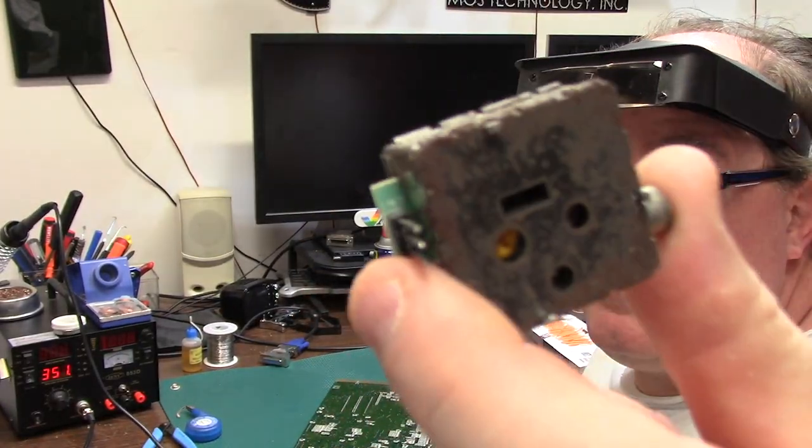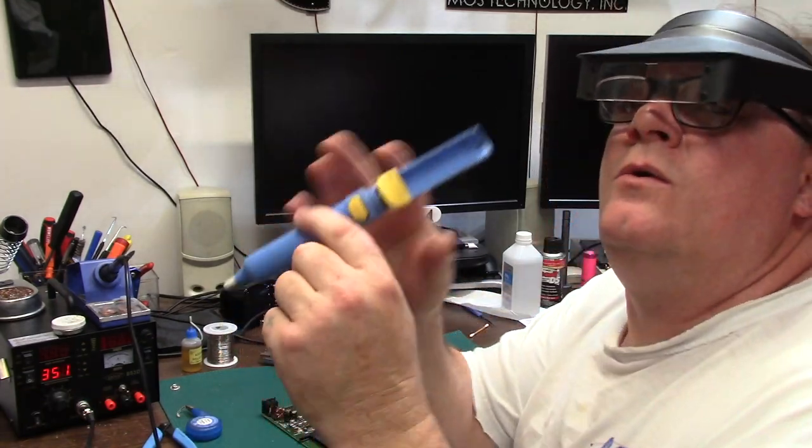I'm going to get the recap started, cut all these off Lorena style. If you haven't seen my Lorena Bobbitt method of removing capacitors: it involves clipping the cap off with a pair of snips, picking off the aluminum base and plastic rubber gasket, then snipping the two nubs left over from the legs, removing the final piece of plastic, cleaning, debriding, and fluxing — washing it down after you debride the final legs that are sticking up. Check out many of my previous videos where I show that entire process.